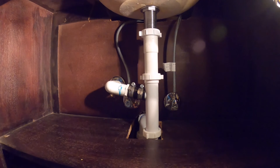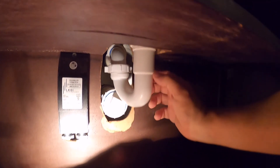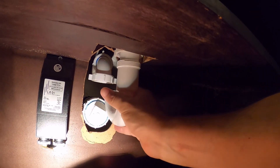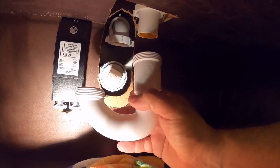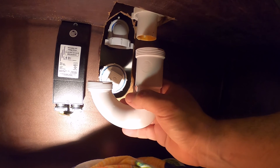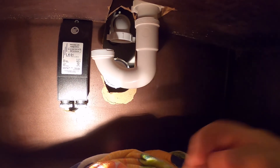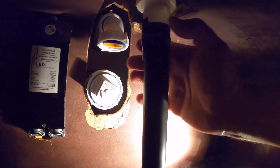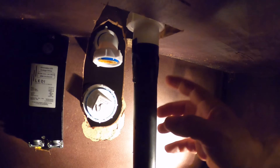You've got to make sure these lines are clean, and I'm going to show you how. The p-trap is easy — you just loosen these couplings here, this one has two, one here and one here, and then pull the p-trap down. The first time you do this it's going to be full of water, so you want to put a bucket underneath to catch any water that falls out. Then in place of the p-trap I attached the hose to my wet vac and put some duct tape to make a seal.